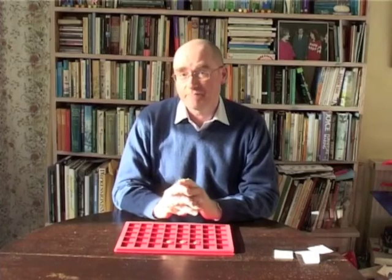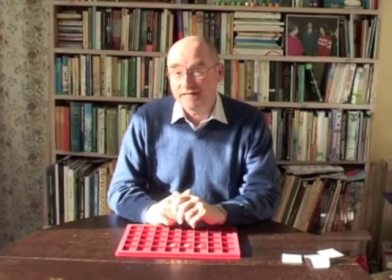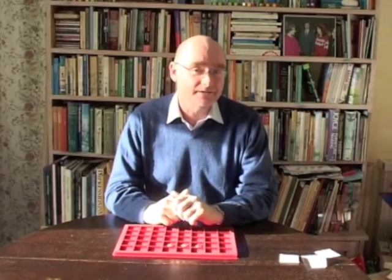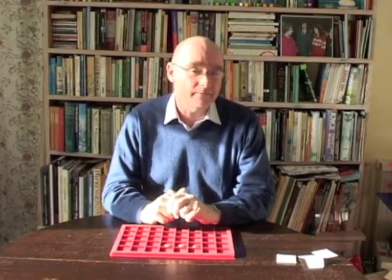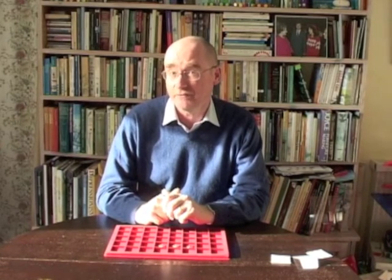The next stage in the process involved striking the coin. The blank was struck between two dies to make the coin. This had the effect of compressing the silver enriched layer, producing a coin of relatively base composition, but one that looked as if it were made of pure silver. The process was highly effective. Pliny the Elder noted that it was difficult to tell by simple testing whether objects treated in this way were made of pure silver or not.